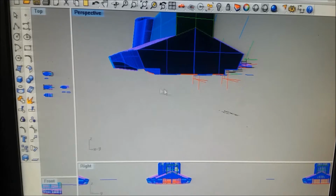Now, this is called a three-point hydroplane because there's a flat panel under the bottom of the transom back here that slants up going towards the front. And this rides on the water because the center of gravity lies between the sponson and this trailing edge. These kinds of boats tend to sink at the dock. They hold them up with cranes if there's any kind of a wake or waves or something, because they'll wash right over and put them on the bottom.